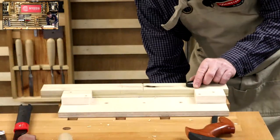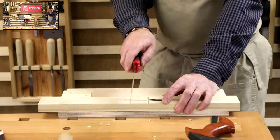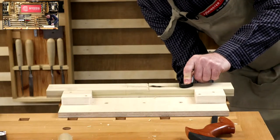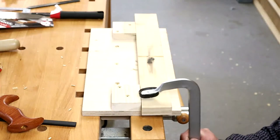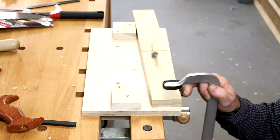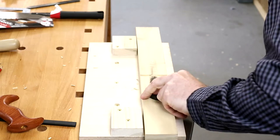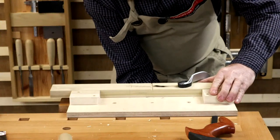Now, if you were going to use your Japanese saw and it's pulling and you haven't got anything clamped, you'd be better off the other side of the block, come round. But it's so much easier to clamp this down. It doesn't take anything. Now, I know we've said with the board and we explained how it works. So now what I'm actually doing, hey, can you go to four, please? Just to try and give the guys an idea. We've got the clamp. It fits right underneath the vise. Clamps the work up. So it gives us a way of holding everything right down to there. Really good for that. So the clamp's coming right down to the bottom of the vise that we've got. Bring that in. So it locks everything in place nicely, and so simple. Bring them over up against the side stop.